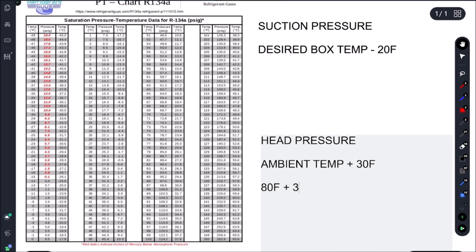We're getting 116°F, so we have a little bit of high head pressure — could be non-condensables in the system or a plugged condenser. At 110°F, that would equal 146 PSI, but really I want to focus on the temperature. Let's keep it simple: we're looking for 110°F condenser saturation.